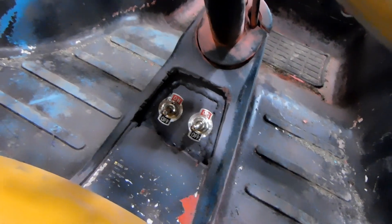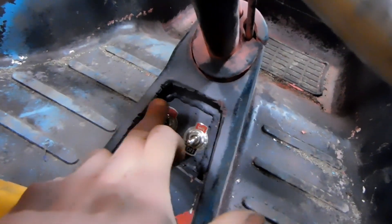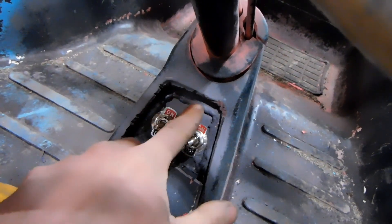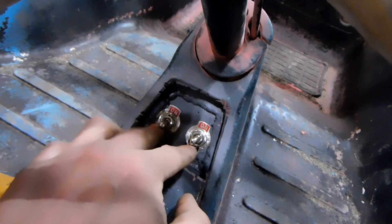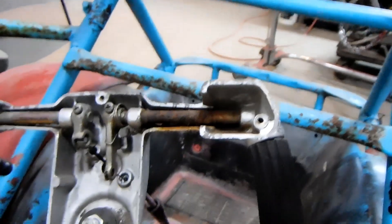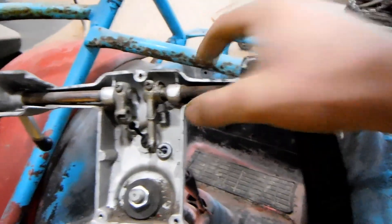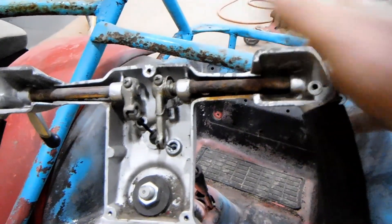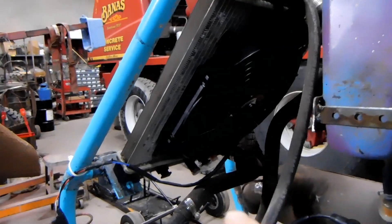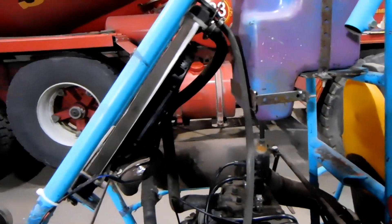This switch makes the fan turn on — fan off. I cut out the fiberglass slash plasticky little cover and then went down to the frame and had to cut a hole and then weld in a block-off plate to mount the switches. Nothing super fancy. My plan is to mount the kill switch up here so that when you're driving it you just have to reach over and it kills the ignition. I have the fan wired so that it moves air from here and pushes it out through the back of the radiator.